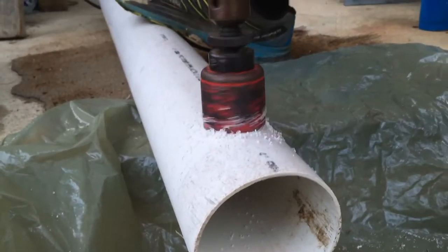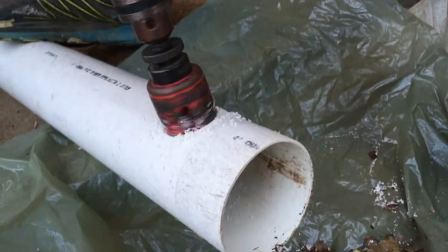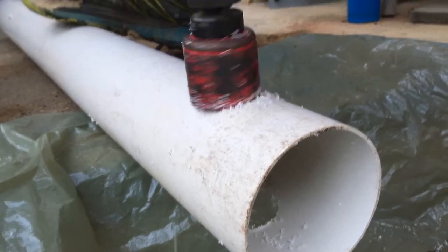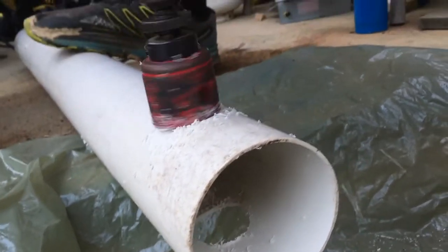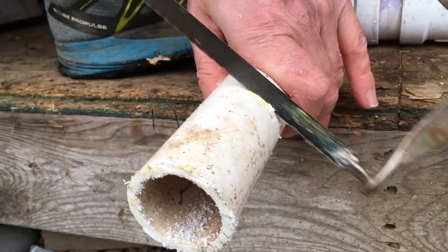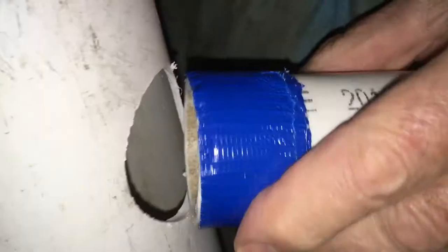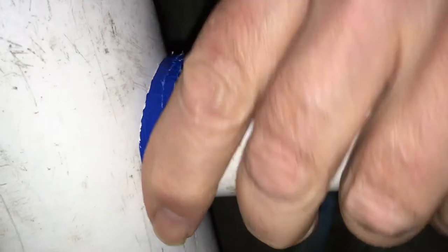These large holes in the other end of the PVC frame will hold the top roller, which is stationary. The top roller is cut from the same 1-inch PVC pipe as the bottom roller, but it's a little longer. This allows it to be mounted tightly in place in the holes on the top, thus forming a stationary roller.